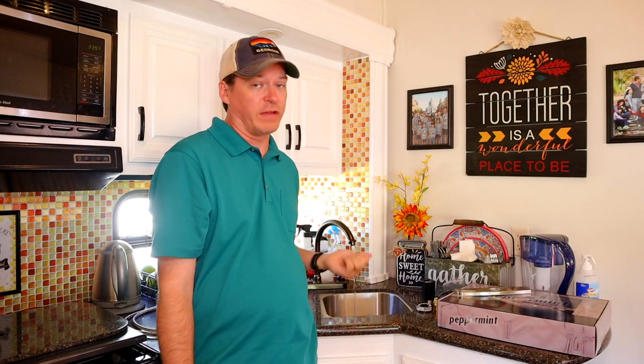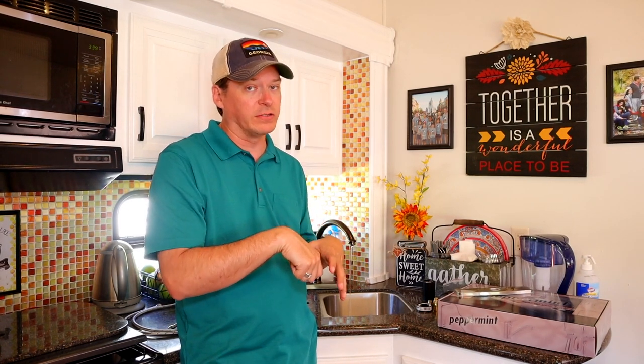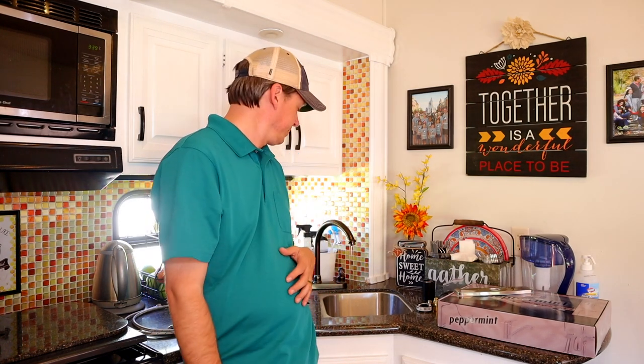So you can turn the water faucet on. He's gonna go out and turn it off. Even after it's off, you wanna let it run for a second until all the pressure's off. There'll definitely be a little bit of water still left in the line. So when you unhook it, have a little towel or a little bucket to pour everything down into. Just again, less mess you can make underneath, the better.